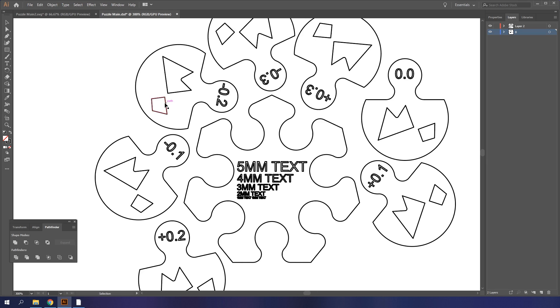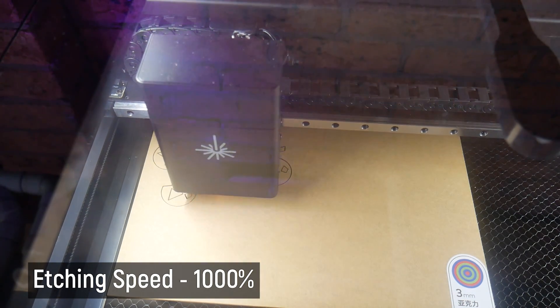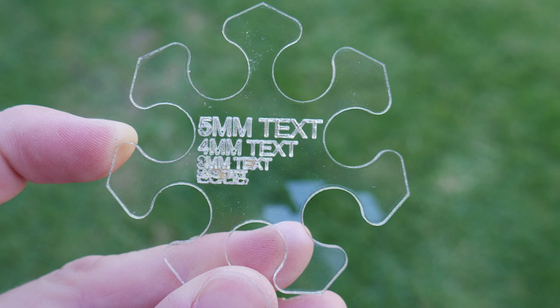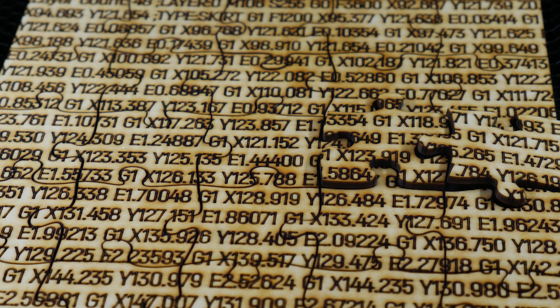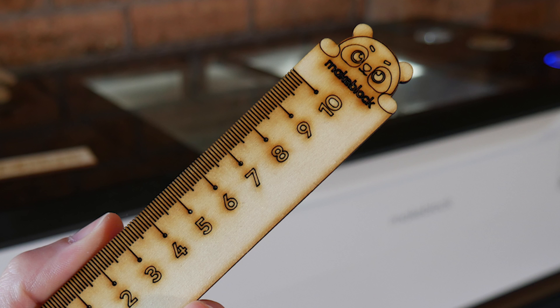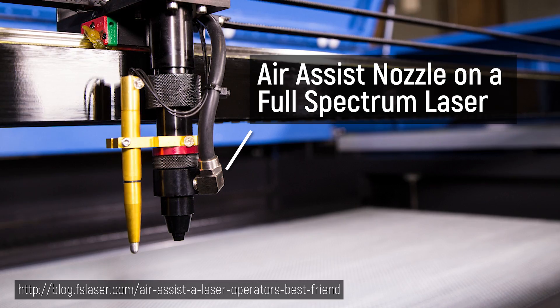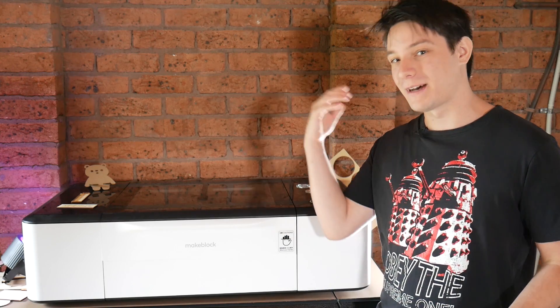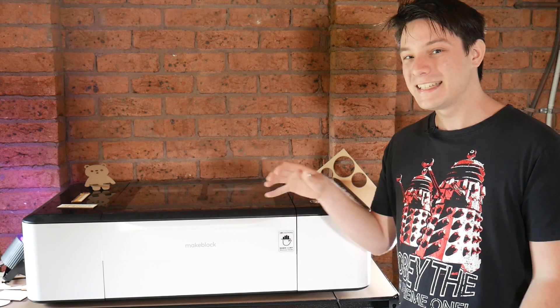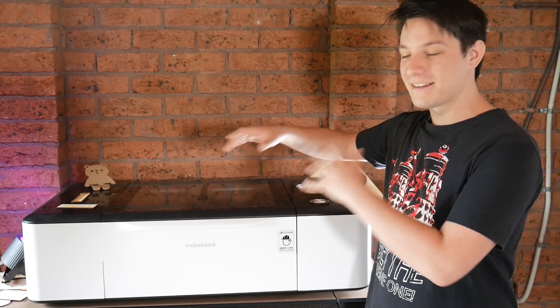Here's a first on Maker's Muse — let's look at my laser cutter test models. I designed this to test the accuracy of this machine, how clean the edges are and how defined edges are. The parts cut by the Laserbox are very precise and fit together well straight off the machine. There is a minor kerf there, but it's totally easy to manage. However, cuts and especially etches leave a bit of a smear on the material. This is because there's no air assist in this machine, which is a real shame. An air assist is basically an air pump with a nozzle aimed at the cutting area that forces the smoke out and the cut material down and away to be pulled out by the extraction fan, instead of just pooling on the material. You can mitigate this with etches by using a protective film and pulling it away after the etch, but it's not ideal. I'd like to see an air assist added on here.